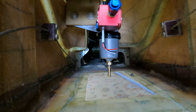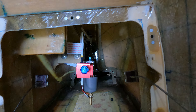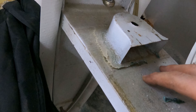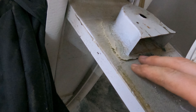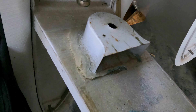I've got to figure out how to route the brake line so it's not in the way, and I need to order a return fuel line for fuel the engine doesn't use and sends back to the tank. Looking at the spar, either the release agent wasn't fully removed, and you can see a little delamination starting. I've already started working on it — it looks worse than it was. It was just starting to lift here; I could get a chisel under it and it just pushed away easily.